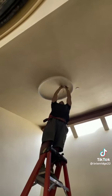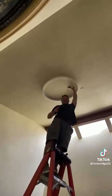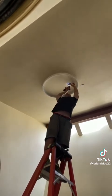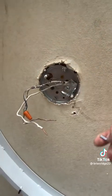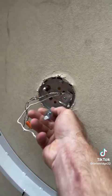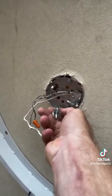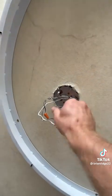I slid the pancake box over the wire and these two bolts, and then I'm just gonna install it to the joist and the screw. After getting the pancake box installed, I'm gonna install this hook into the pancake box so that I can hang my chandelier from the hook temporarily while I wire it, and then I'll be able to install it to the bracket.